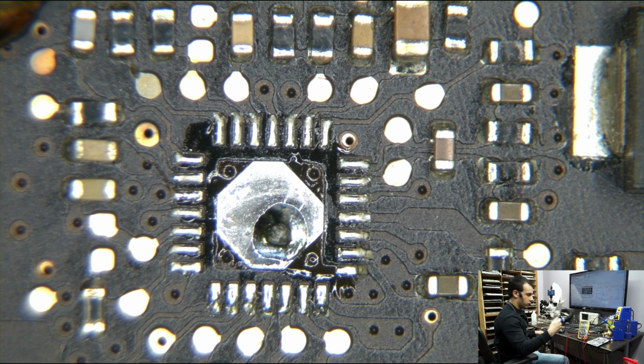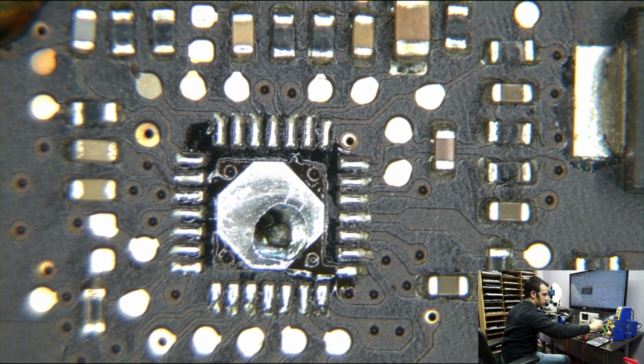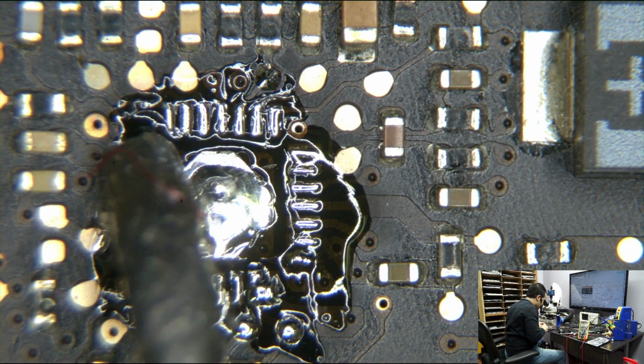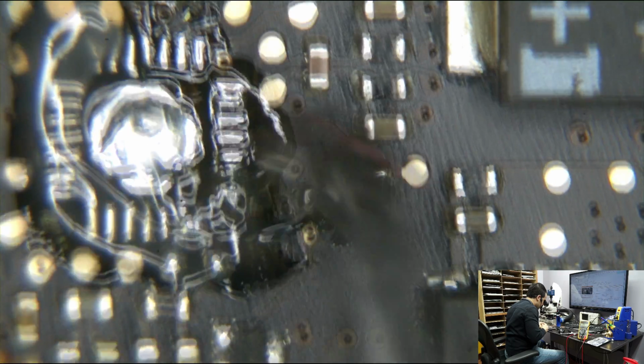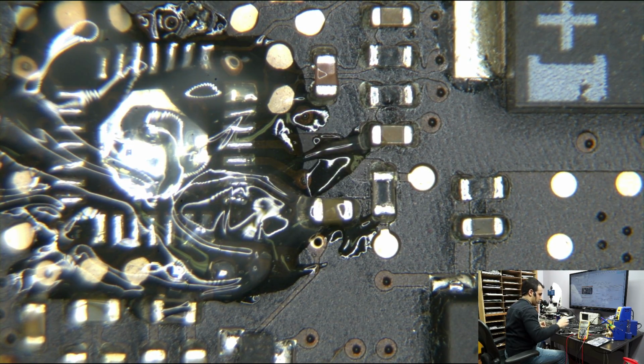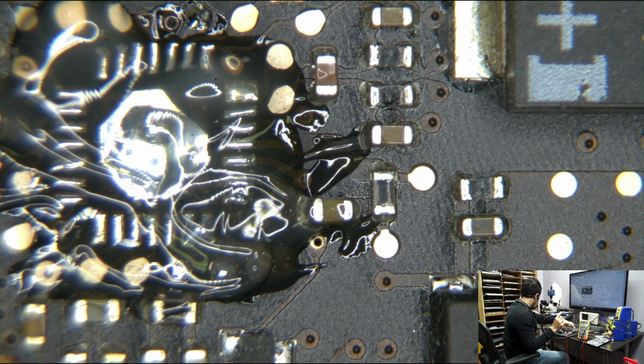Okay, we're going to get a dead board. Dead not because the ISL is bad, but dead because it has a hole drilled in it. A hole poked through it. I don't know who decides to put the holes in these, but there's a short on the pads in the bottom right corner, but that'll get fixed later. It's important to remember the orientation of the chip. Obviously, if you put it on the wrong way, it will smoke.